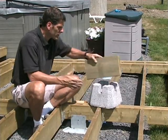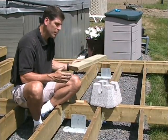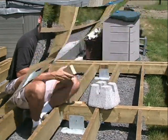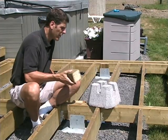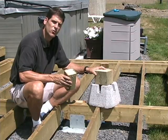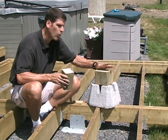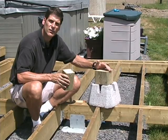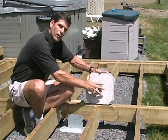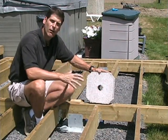The joists or posts sit in grooves — they aren't secure, so again, a potential safety risk in high wind areas. They also only hold a 4x4 post, not a 6x6 post, and most of the industry is moving towards 6x6 posts for a whole host of reasons. They also have a relatively small surface area, so you'll have to use more of them to distribute the same amount of weight on any given deck.